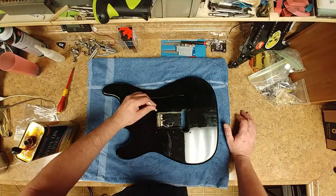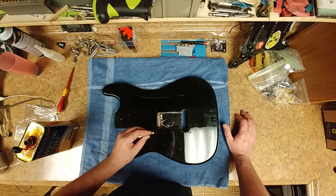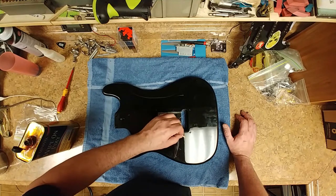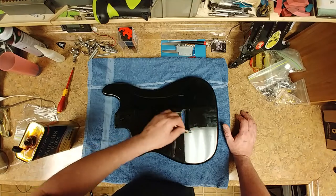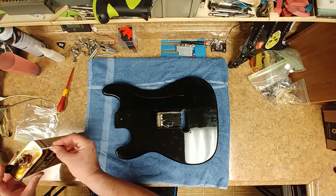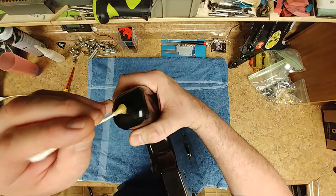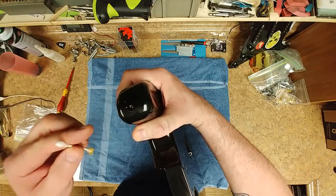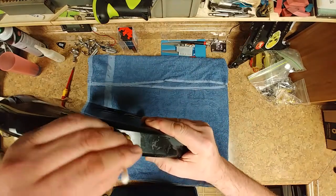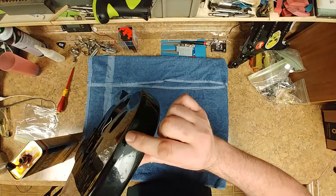When I start sanding with water, I don't use a lot. I use alcohol and put soap in it as well as a lubricant so it evaporates faster - the alcohol helps it not soak into all the nooks and crannies like screw holes. But this sealing step helps out a lot. Anytime I do a wet sanding on something, filling up the holes first is a good thing. You can see it getting down in there by the color of the wood - the wood actually starts getting darker, and right over here as well.